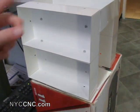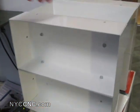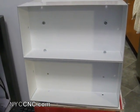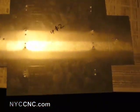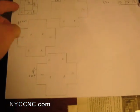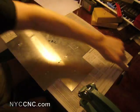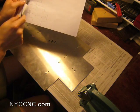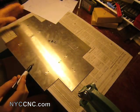Here's a test segment I built. One thing I wanted to point out is there's a little bit of math behind getting the screw alignment correct, because the screws in one box correlate with the screw positions in the other box. Since this is ultimately being done for an aesthetic look, it is important to get those just right. What I've done is built a jig which has all the hole positions on it. I'm using the larger holes, and I've got a sheet of paper which is a side profile noting which piece I'm doing and which holes I circle out. This is box number one — the top front box — and the side wings will only have the left-hand one because this is my right-hand most box, so it only needs to connect to another box on the left side.